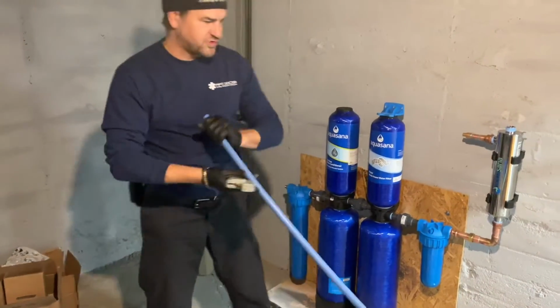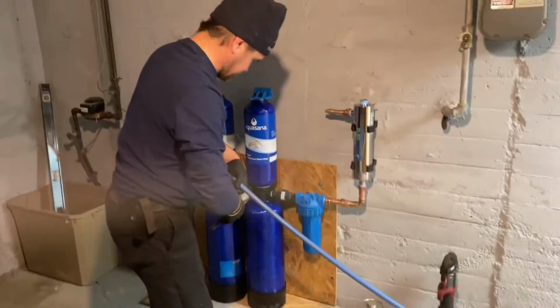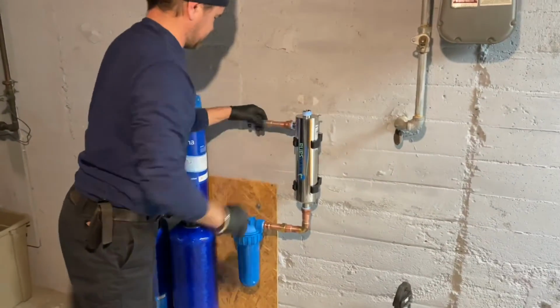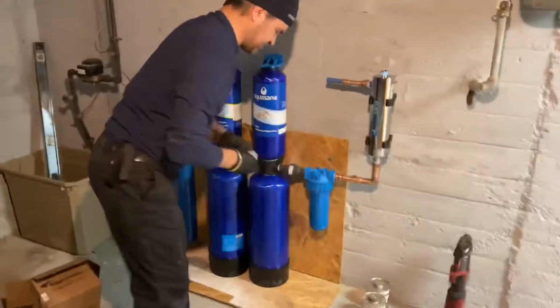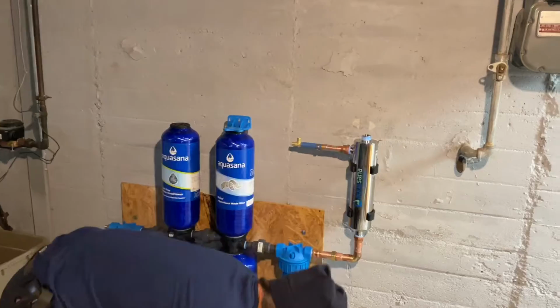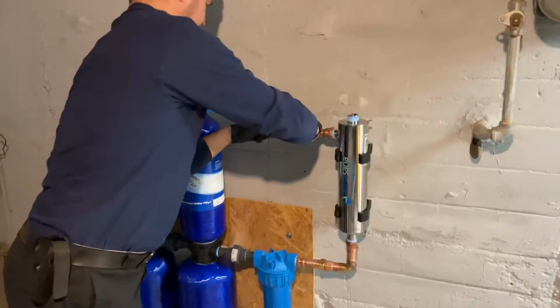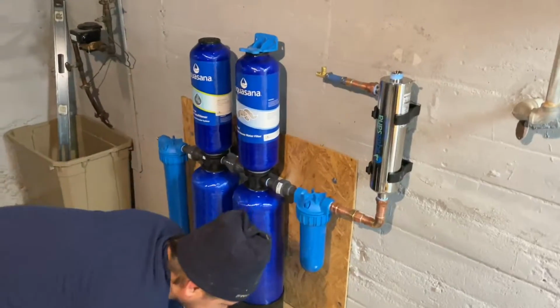Good, all right. Clean cut, 3/4 inch PEX B. This is not expansion PEX. I got some PEX rings here. Let's start by making just a small little nipple right there. I'm gonna put this here. That's gonna go there. All right. Now, they give us some nonsense here. Let's start with this T. Let's put this T here, like that, of course, with the ring. Yeah, the ring's okay. And then on this opposite side, again, a little bit more PEX, a little nipple here. 2 rings, another T.